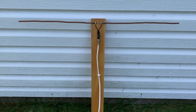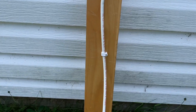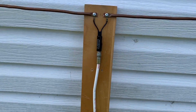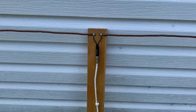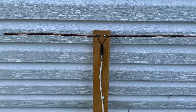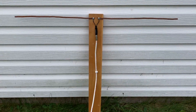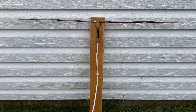And here's the finished TV antenna. I connected the coaxial cable to the transformer and added a staple just to keep the strain off that transformer wire. And if you don't have copper tubing, you can also use a couple of lengths of copper wire, or even coat hanger wire would work fine. And all that's left to do now is find a spot to mount your antenna, either inside or outside.